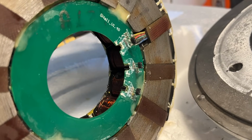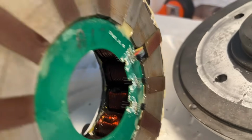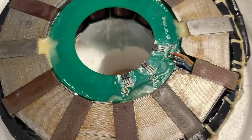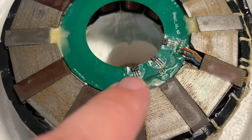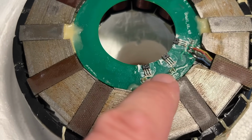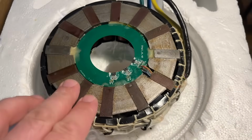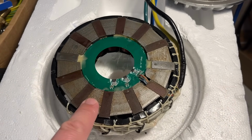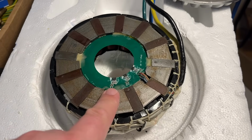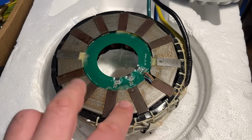And now I need to bend those new sensors on their places and then solder them from the other side. Sensors are in. I still want to measure them so that the continuity is right. The other side is very cramped and very small, so I'm not 100% sure if the soldering was a success, but I think I'll put this kind of together now and we'll jump back to the boat because my multimeter is over there. We'll open this and check the continuity, and if it is okay, we can put it on its place and test it.